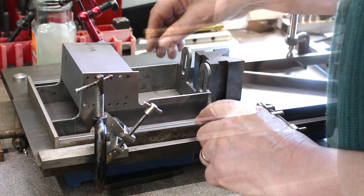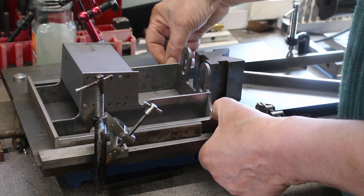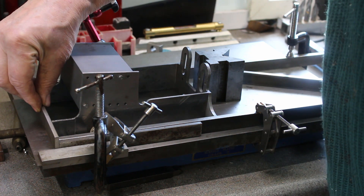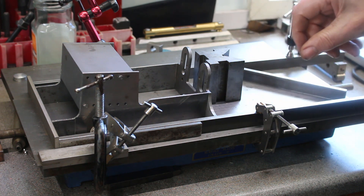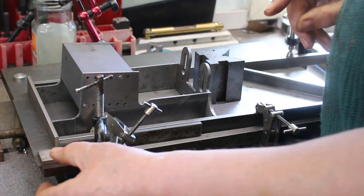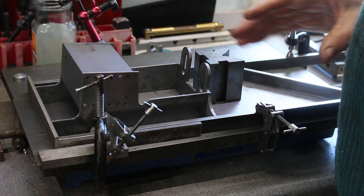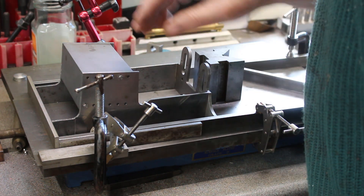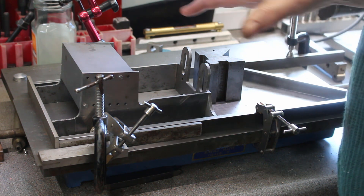The remaining parts of the frame are just a series of bars. We have got two side bars which are 3 quarter by 5 sixteenths. We have got the buffer beam at the front, and a drag beam which fits to the back which we do last. I have assembled it to the surface plate as a reference, clamped my square to the surface plate so everything squares up nicely, and gone through the process of assembling and clamping things in place ready for the brackets which will hold this all together.